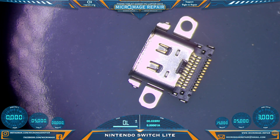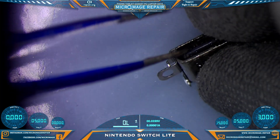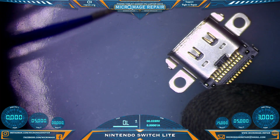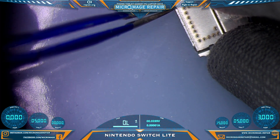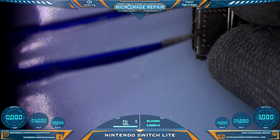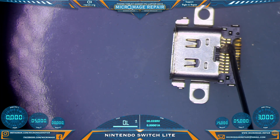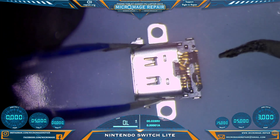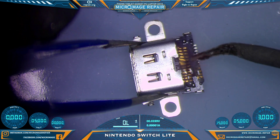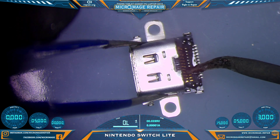We're back and we have shaved down the port. I had to do a little bit of cleaning because there were some slivers hanging off of it. As you can see, we've gone down pretty much to those tabs on both sides — not quite to it, but close enough — and it should do the job nicely. Add enough flux and run it over the pins. No need to make general contact with the iron — we just want to run the solder ball over. Now I need to put into place our protection for these connectors.